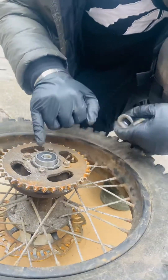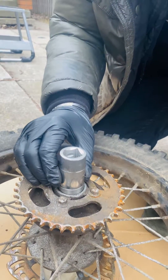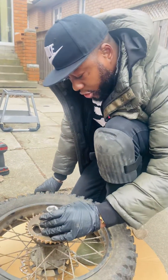Take a look at that. You don't want to knock the inner part of the bearings. Always have something sitting on the outer part like that. And also underneath, I have something supporting.